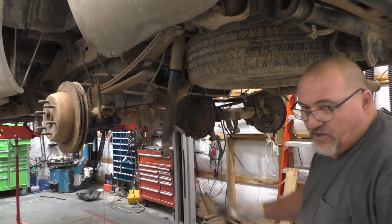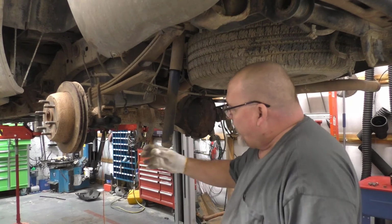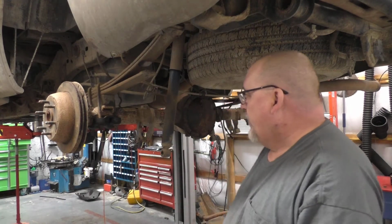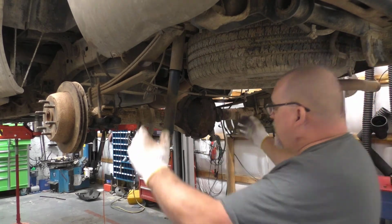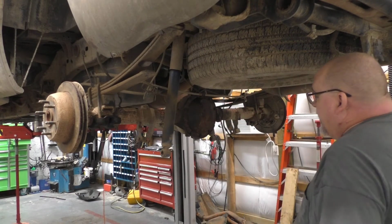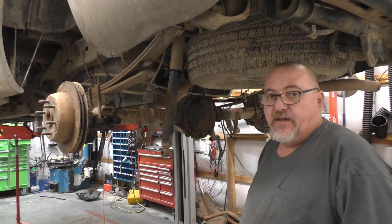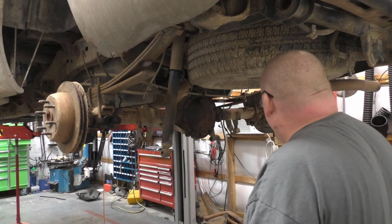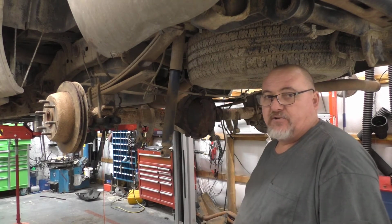We'll go ahead and get our lines all laid out, and one more thing, try to get these cups about even. It doesn't matter if they're a little off, if they're rolled a little bit, but try to keep them even. You may have to pull the spring just a little bit to get them lined back up to the pegs, because they do set inside pegs, and don't think for a second you need to do anything to remove that. Don't. This is what aligns the whole thing. So that being said, I'm going to head to the back right now and hook the drive shaft back up.